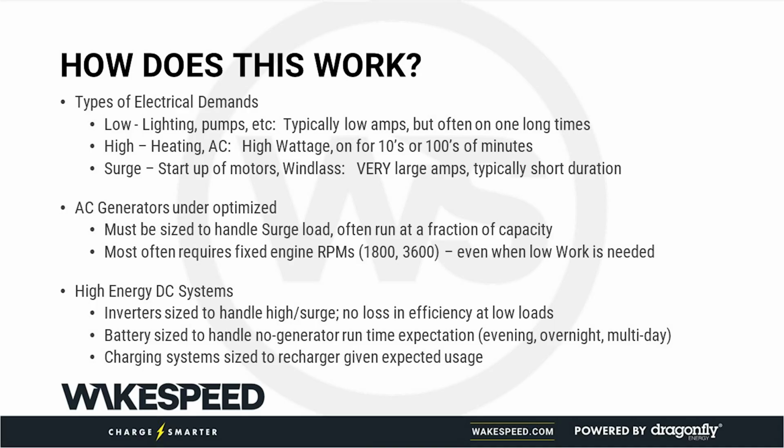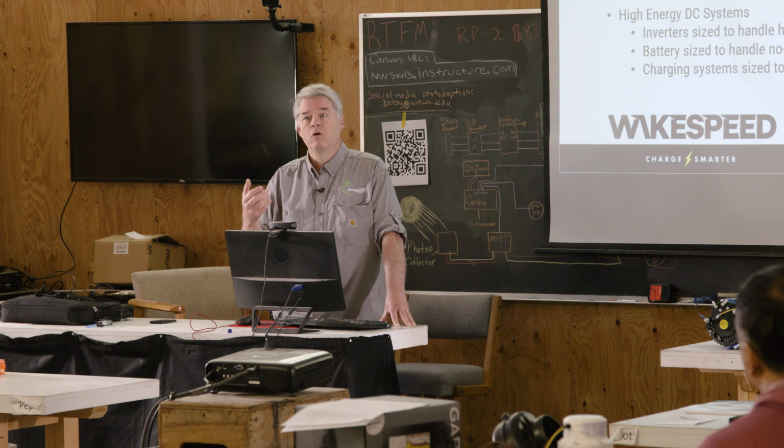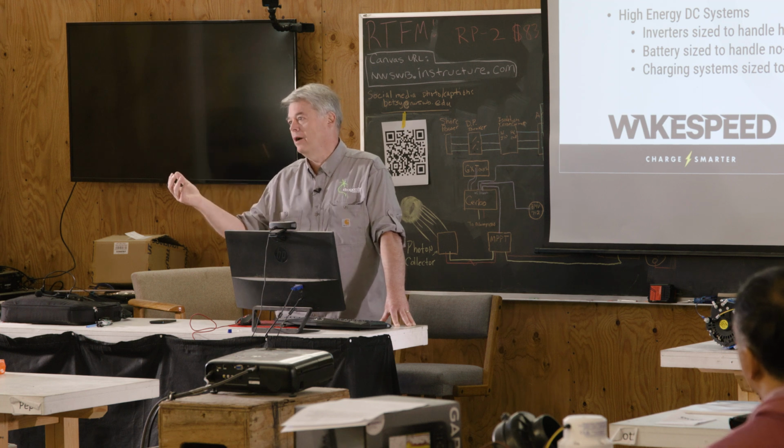The demand for electrical loads, largely air conditioning, is what's driving these types of systems. You need to consider not just the large loads, but the nominal loads, the little small guys: the refrigerators, the lights. Those are still at 12 volts, or in the marine world, 24 volts, and we don't see those changing anytime soon. So as you move forward, unless you have a pure 24 volt install, which does happen, you are very likely going to find mixed systems. That induces some complexity that has to be considered in how to solve it. So one of the first things you want to do is start with what the loads are and what voltage system is best applied.